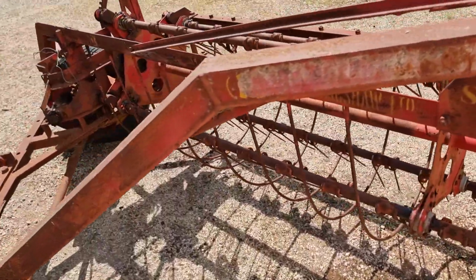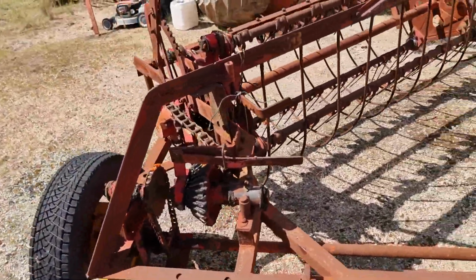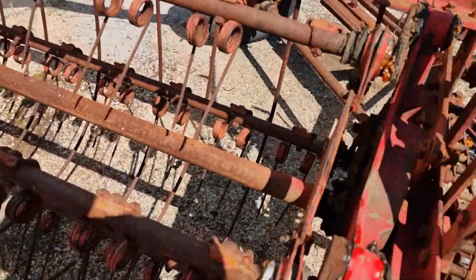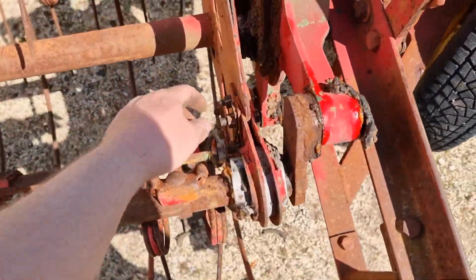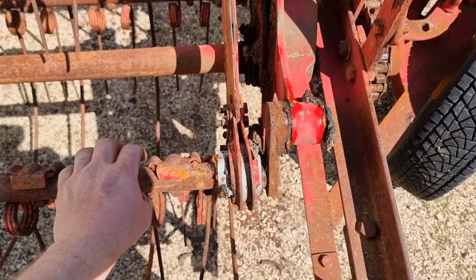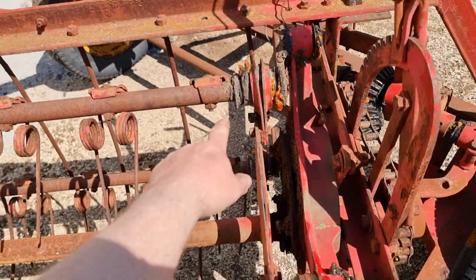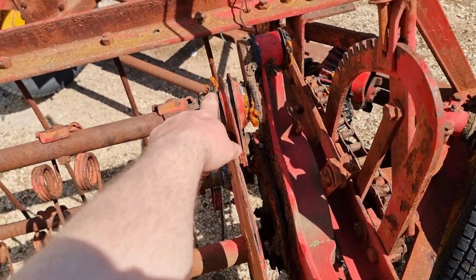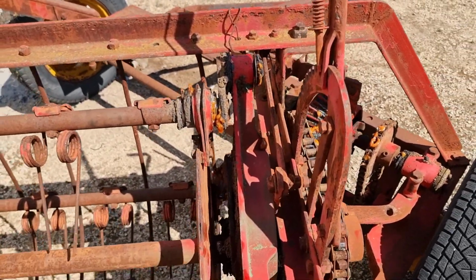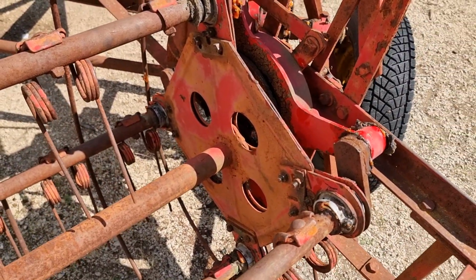So I've just been through this. Oh, it's got a couple of broken grease nipples. I've brutally tightened these up because from the driven end here, they were all loose. These bearings, and they're all spinning. That bearing's grease nipple is half burnt through, but it works. So for the amount of work it's going to get, I don't think it's going to matter.